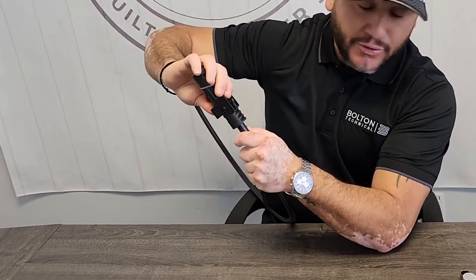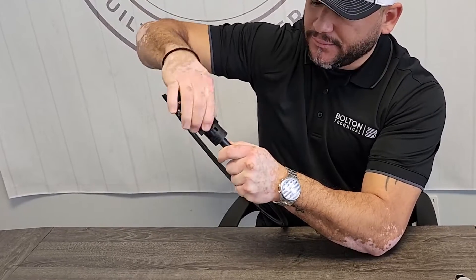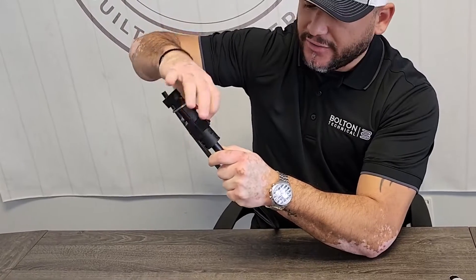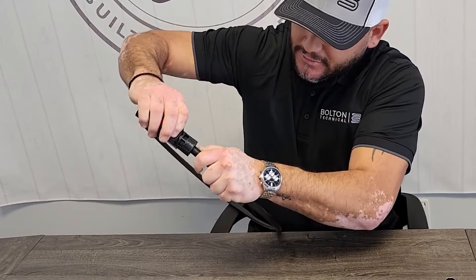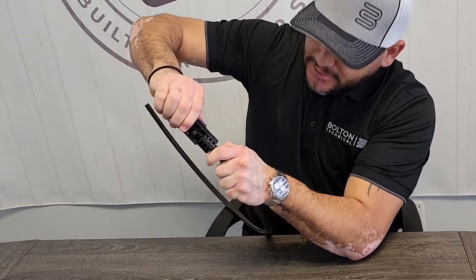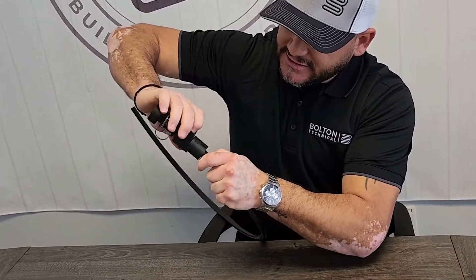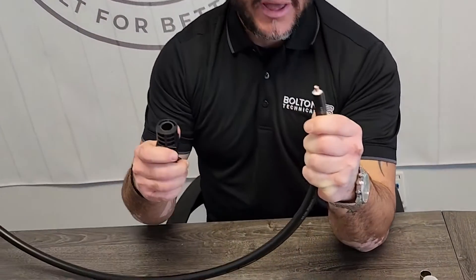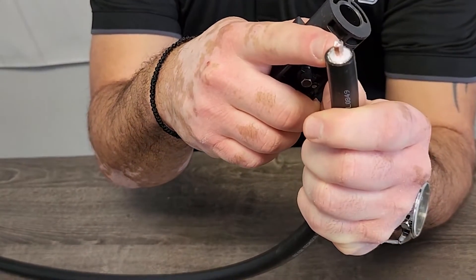You can do this either way — just make sure you do a full 360-degree turn. As I'm turning, the cable will be cut accordingly, and when I feel I've got a good cut on there I'm just going to press to exit out. If it gives you any pullback, that means the blade didn't cut well, so I'll go over again, apply more pressure, get a solid cut, then pull out — and you have a correct prep for the connector.